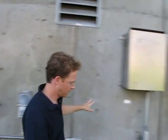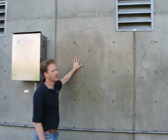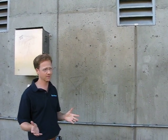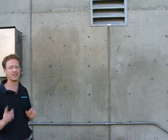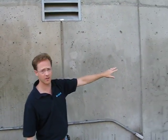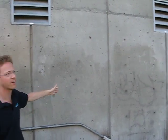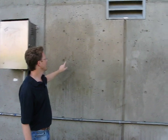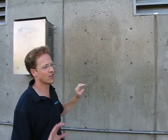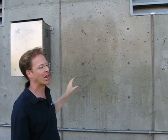On the fourth panel, we've got two sealer and two proofer. On a lot of these walls, because they've had graffiti removals done in the past — and to be honest, the graffiti removals that have been done have been far too harsh. You can see where the pressure washer and the chemicals have carved out of the concrete. The darker area is the area that's been previously carved out, and it also gets a better wetting out of the substrate where the coating is applied, so that looks like it's enhanced.